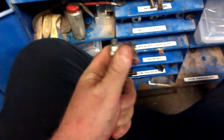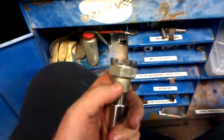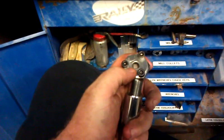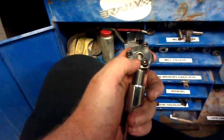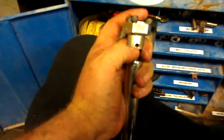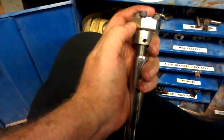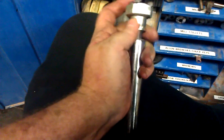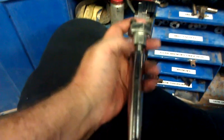It screws off. What this does is it screws on to the end of the barrel and it acts as a gas trap. That hole right there is perfectly sized for a 9mm bullet with just a little bit of free play in each direction. Everything is perfectly centered, perfectly aligned on the barrel. The barrel currently is still 6.5 inches — these threads were cut as a test because this thing is getting shortened to 3.5 inches. With the trap on there it will be more like 4 inches altogether. That hole there is a set screw that's going to hold the gas trap onto the barrel. I'm not 100% sure I'm using it but I think I will. It's going to be painted and otherwise decorated in the final version, but this is fully functional and perfectly centered — everything is absolutely mechanically dead on.